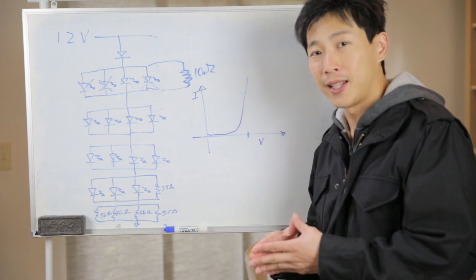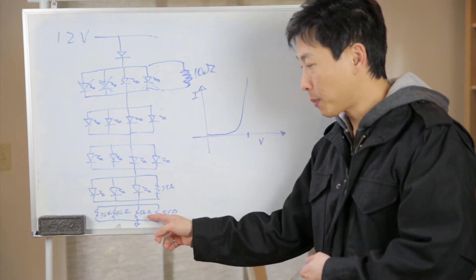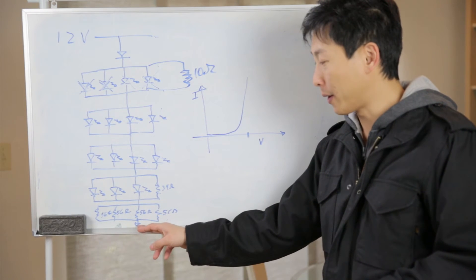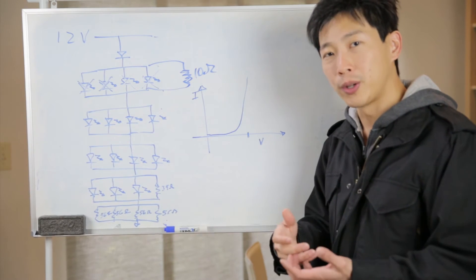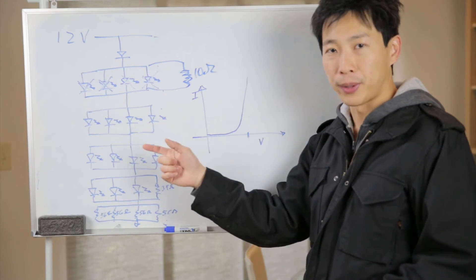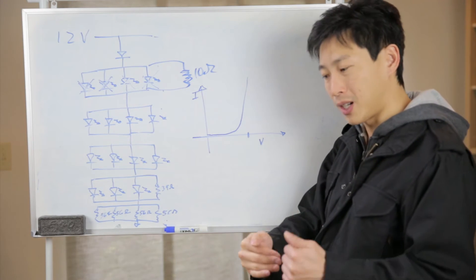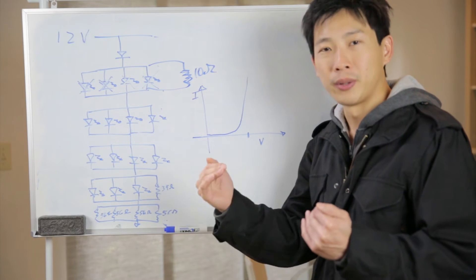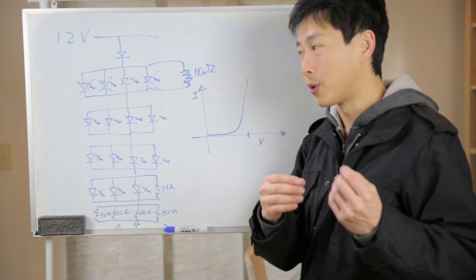To test these LEDs, it's best to put a battery across them with a current limiting resistor. But because we're testing this module, you don't really need to add current limiting resistors since they're built in already — you just put a battery right across the whole thing and measure the voltage to see which one is shorted open. For this thought experiment, you go through this whole array and supply about 20 milliamps, which is pretty low. LEDs are generally driven at 20 to 100 milliamps or more depending on the type.